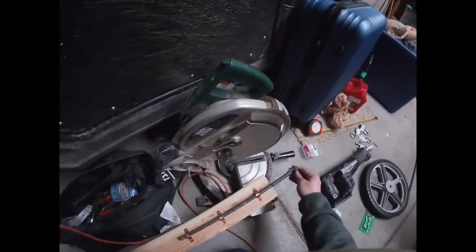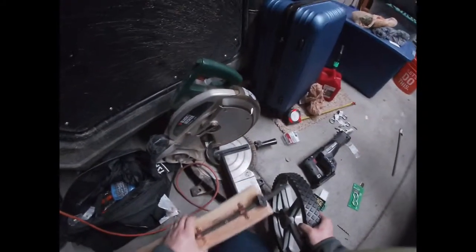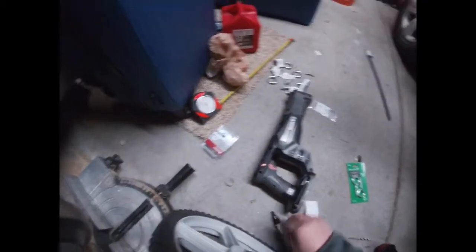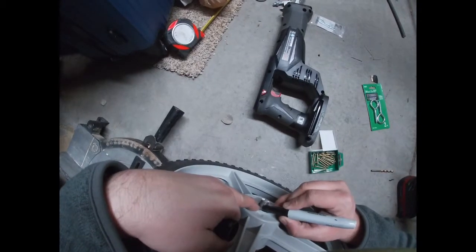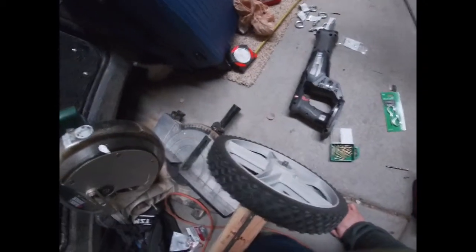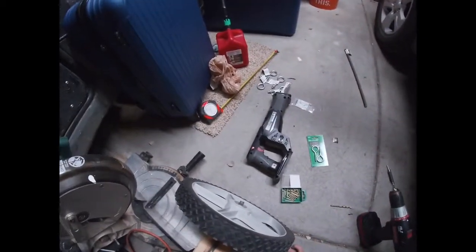I like to knock off the metal shavings so I have a free area to work. Now go ahead and put the washer on, then seat the wheel on. Looking back at the rod end, take a secondary washer and place it there - that washer is going to tell you where to put the pin. Mark it pretty close to the washer. You're basically going to drill one last hole there, and that's where you put your pin. Once that's done, the wheel part of this project is pretty much complete.